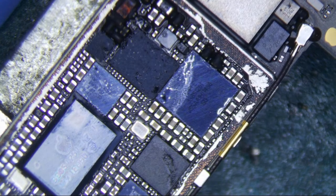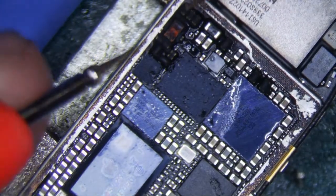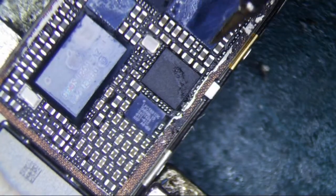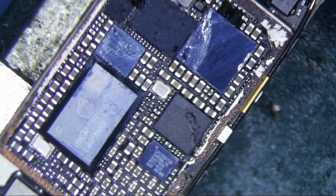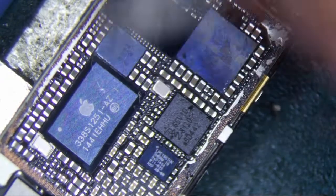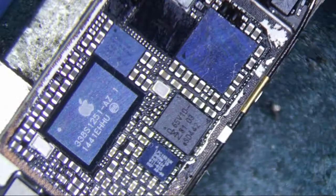If you want, you can test to see if your via — your L1 — is short to ground. You can do this: as long as it doesn't beep, you're good. M1 is actually under the chip so I don't test it. That's really about it. Get some isopropyl alcohol and clean it up a little bit. You should probably wait about five minutes for it to cool down and then test it.